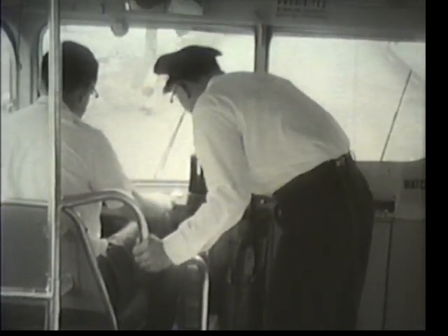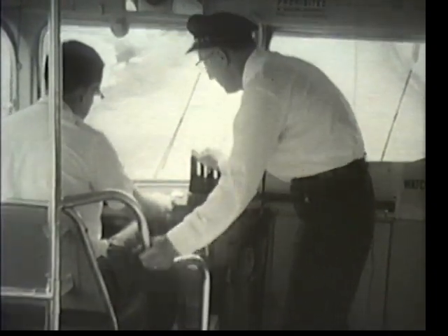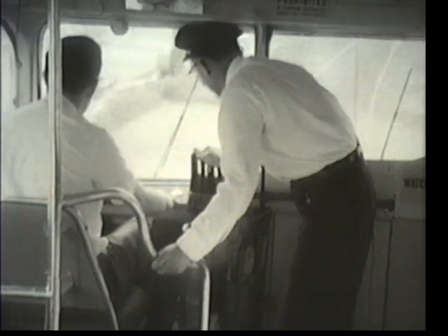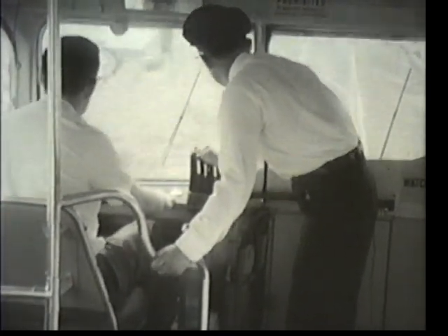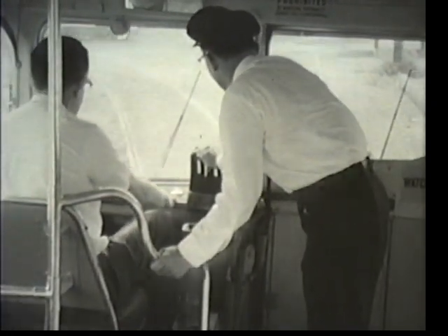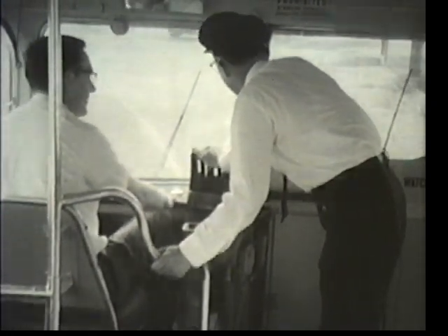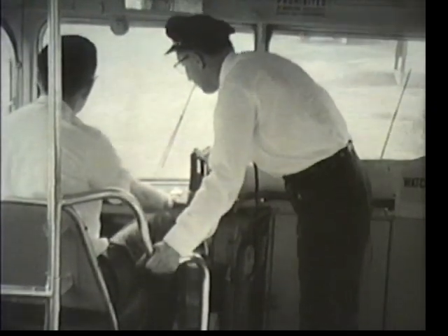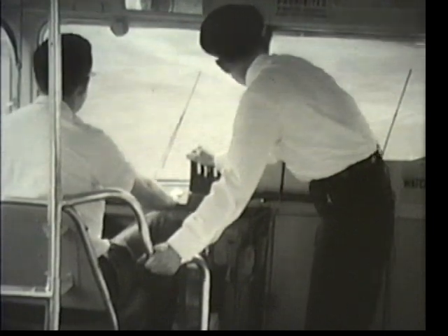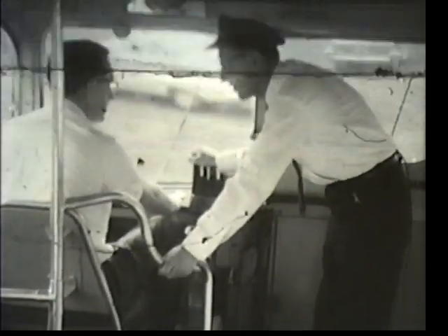Engage the power pedal a little more. That's the way. Now brake it down, use the brake, just gradually. Now, in safety — I think we're coming onto a switch. Coast over that particular switch, and always operate over a switch with your car under control at all times, so as to be able to stop short of the switch point in case the switch fails to operate.